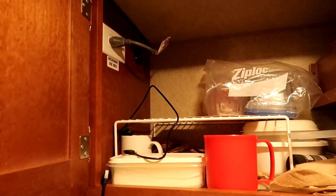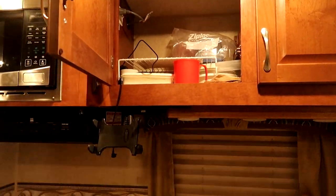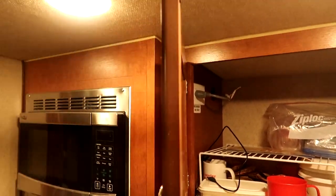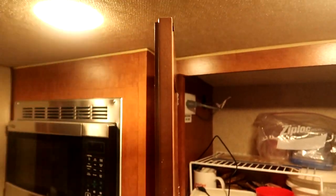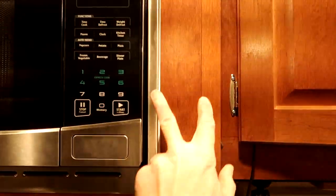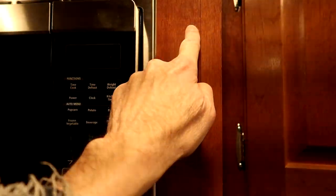The remodel box has little wings on it, and when you tighten down a Phillips head screw the wings swing out and clamp onto the mounting surface to hold it secure. Before doing this upgrade, you want to check if you've got clearance behind or next to your microwave. You can see here that the outlet is mounted higher than the top of my microwave, and there's also plenty of space next to it if the outlet were mounted lower.